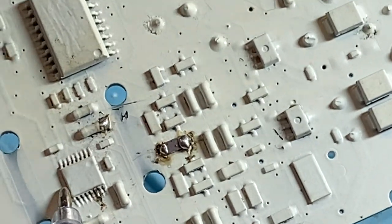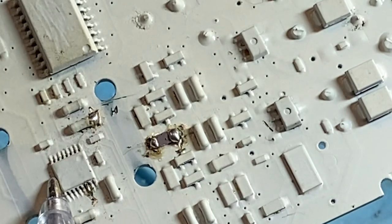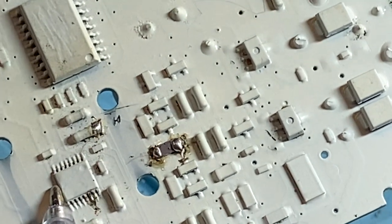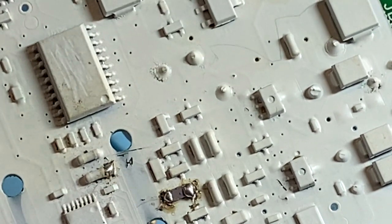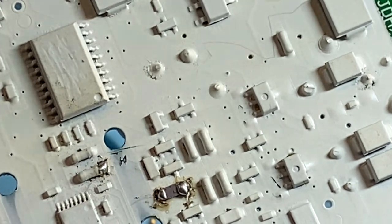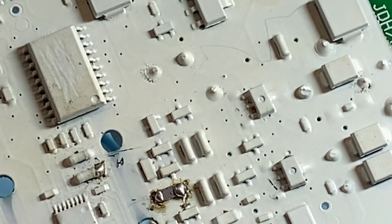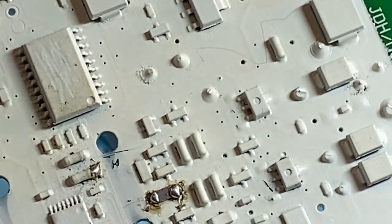This here is, what is it? It's a 4053 multiplexer. That selects your DD, cancel, mono, how the configuration is from your two input stages into this. This can play up. I've had these play up, and it won't change modes. Or it will stay locked in something. It won't budge from cancel. It'll stay there, or stay in mono, or stay in double D, or do something completely different and try and put them all on at once or whatever.